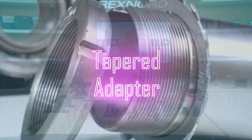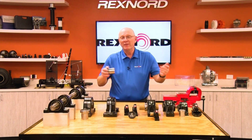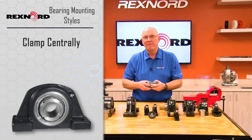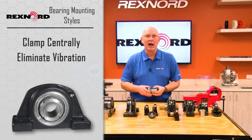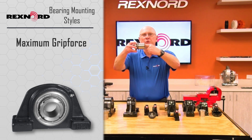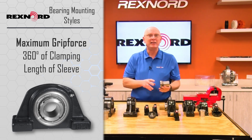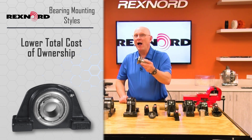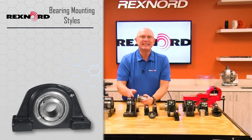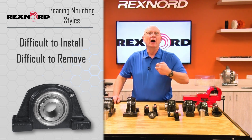Tapered adapter is the ultimate shaft holding power. What tapered adapter does is take a tapered sleeve and a tapered bore and draw those two tapers together, squeezing the tapered adapter sleeve over the shaft. The first thing is I clamp centrally — if I clamp completely centrally, I'm going to get rid of vibration completely, and as we know, vibration is a bearing's enemy. Reducing vibration is going to increase bearing life. I also get maximum grip force because not only do I have 360 degrees of clamping, I also have the full length of sleeve clamping power. With all that done correctly, I'm really going to reduce my cost because bearings aren't going to come loose. One problem is that traditional tapered adapter can be difficult to install and sometimes even more difficult to remove from the shaft.